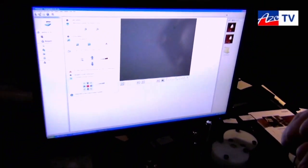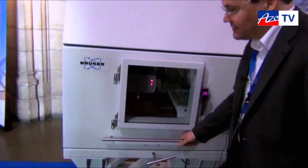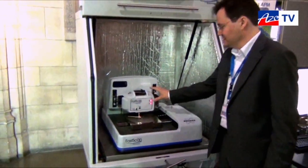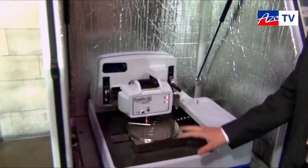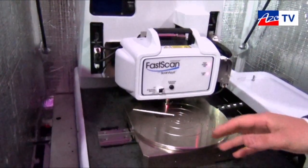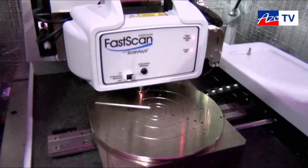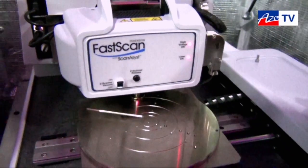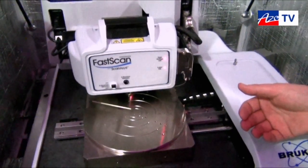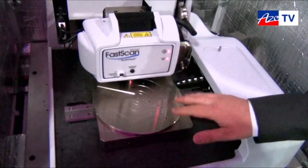Maybe we can take a quick look at the instrument itself to make this easier to understand. It's a tip scanning system. Here's the scan head, and below we have the stage where we place samples. You can see here the possibility to place wafers up to 200 mm, but that's not the only type of sample which can be imaged. Many researchers who have small samples can place many of them on this chuck.